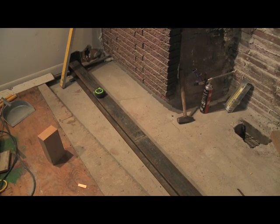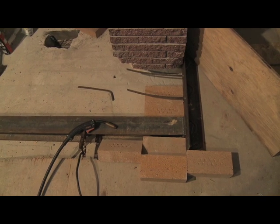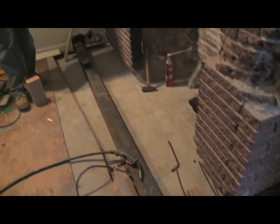We installed the steel beam, and we've placed the column, steel tube column, in the basement to support this end of the steel beam. The other end of the steel beam was grouted solid to the foundation wall below. And what we're going to do today is set up to pour the support slab for the masonry heater unit. We have a little bit of welding to do on site here. We have a ledger angle that will actually carry the facing stone. It's a river rock, so it's pretty heavy. So we have a steel framing, steel angle that ties into the steel beam that we've installed.